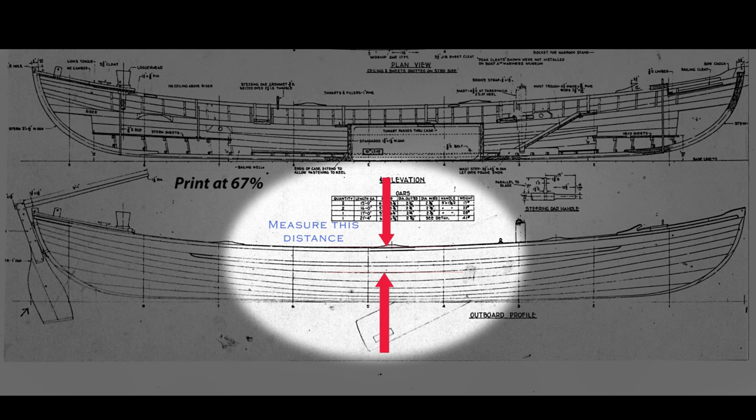The number 7 and 8 planks are pretty wide, roughly 9 inches each. You should be able to use the plans to lay these planks out, but you may need to make small adjustments for your model. The important thing to remember here is that you need to locate that number 7 plank on the hull accurately. Much of what happens in the next few steps will be reliant on doing that carefully and accurately.